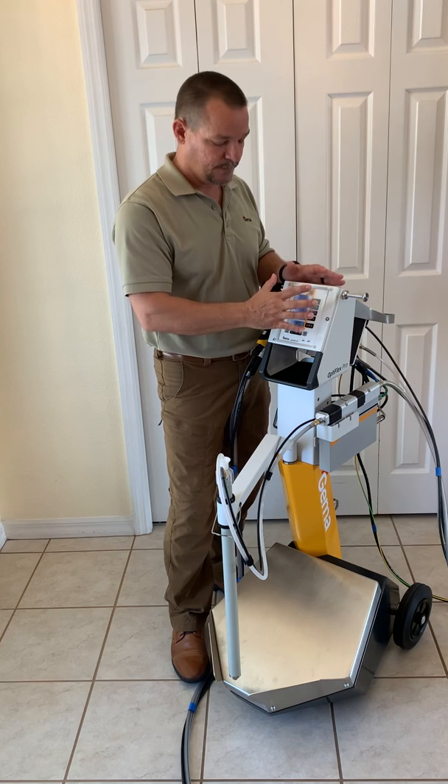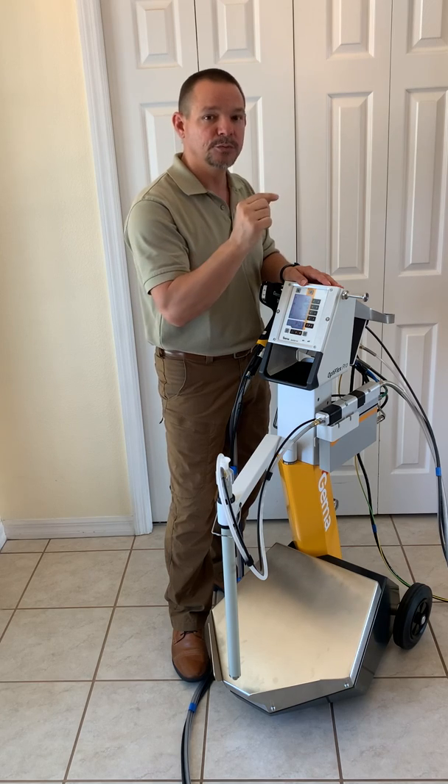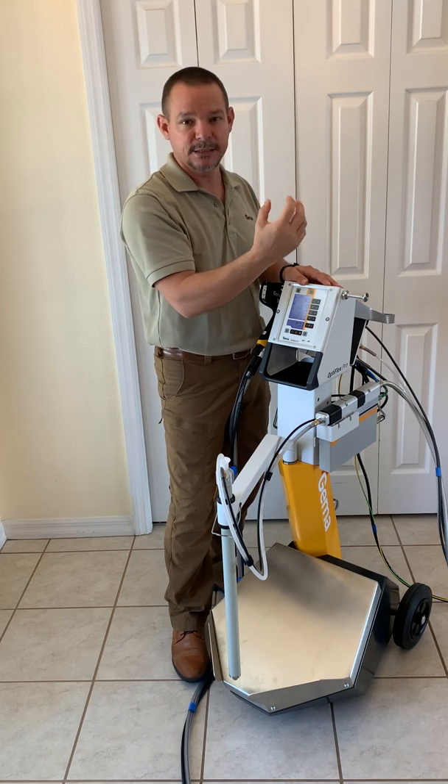This runs at 110 KV. We also have very precise current control, which allows you to do multiple coats — candies, triple coats, four coats — building up powder without getting as much back ionization out on the product.